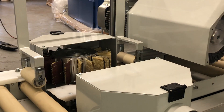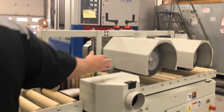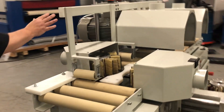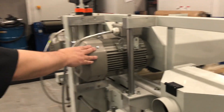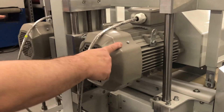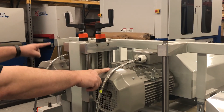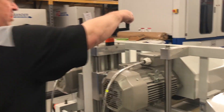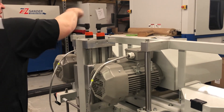And since we are doing wire brush and nylon brushing, we have upgraded the motors on this package to go from one and a quarter up to three horsepower motors. And we need to have head one and two independently adjustable, so we have independent adjustability on the two heads.